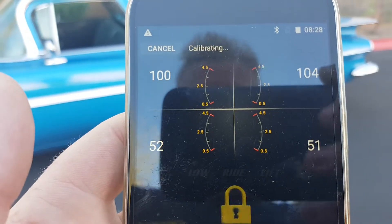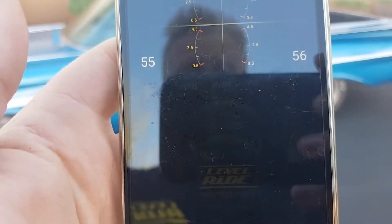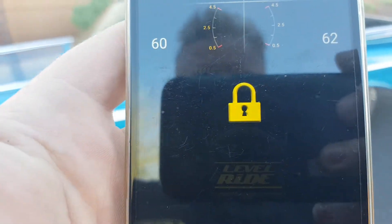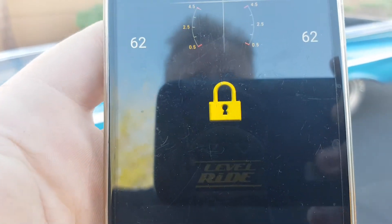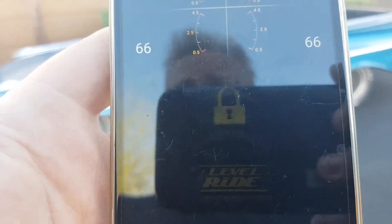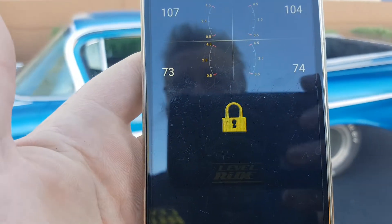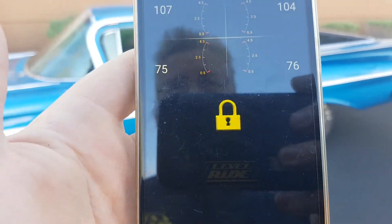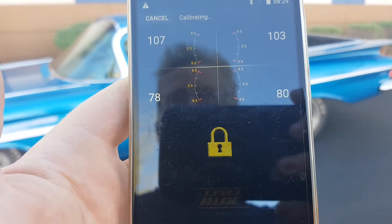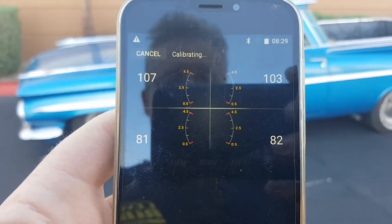The compressors have come back on. You'll see the pressures starting to increase. It'll still say at the top that it's calibrating. For any reason that it stops calibrating or cancels, you'll see that the lock symbol will go out and you'll have to start again. That'll be because of one or two things: your pressure, your voltage, or the tank hasn't come back up again — something in your settings that you haven't checked before you started the calibration.